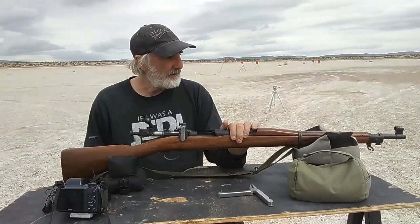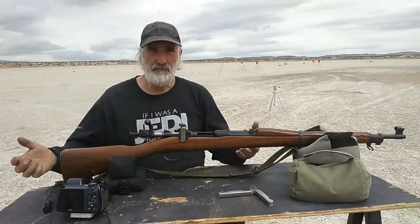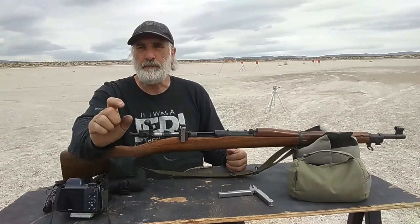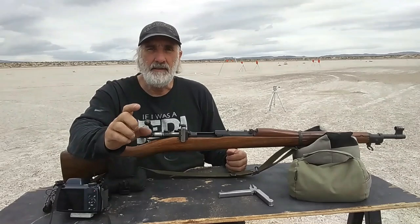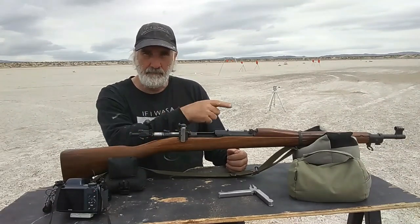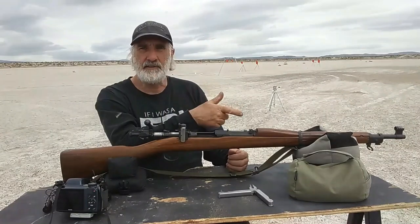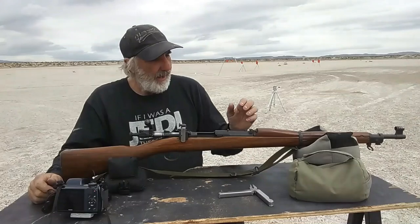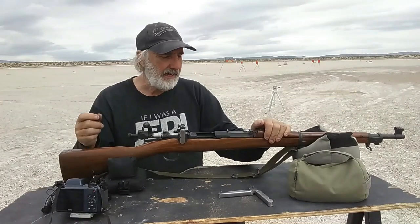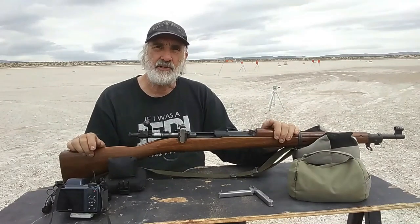So my father looked into it and found out what a star-gauged barrel means. It has to do with the broach. People call them button pulled right now, but it's a broach. After they cut the minimum bore size, you run the broach through there, and that cuts the grooves. When you have a brand new broach, you run them through there. It's not a star gauge yet. They run so many through, and then they list it as a star gauge.